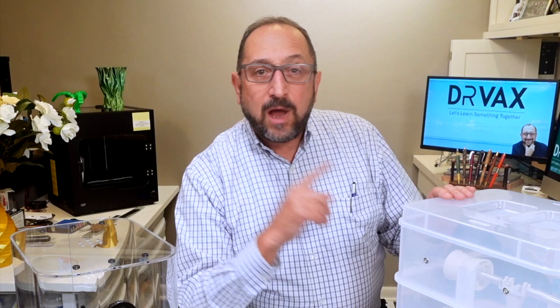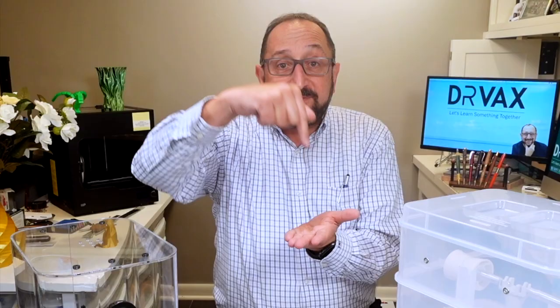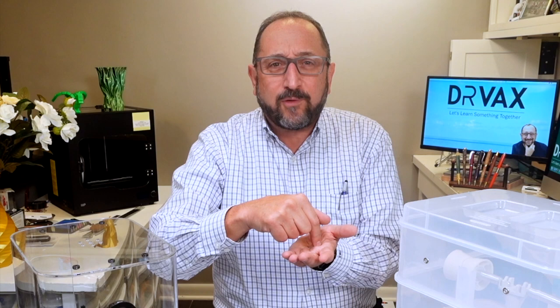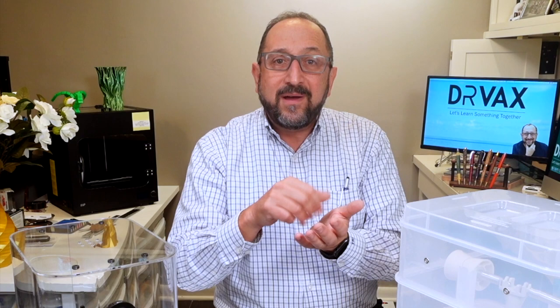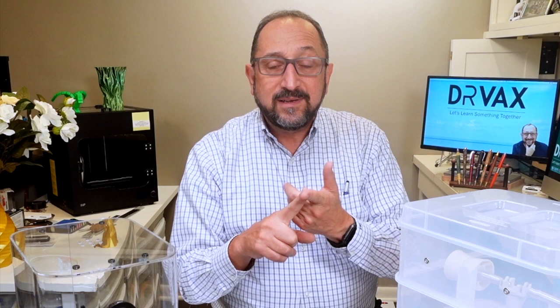Why is this particular test such a difficult stringing test? First, because the very top of the towers is smaller than the print nozzle size. So you're placing a dot of filament. If your print nozzle is 0.4 millimeters, how do you place a dot less than 0.4 millimeters? You have to try to under-extrude, to press less filament through the nozzle - very hard to do precisely. That causes additional filament to build up on the end of the nozzle, and that extra filament, when you make a travel move, causes stringing.